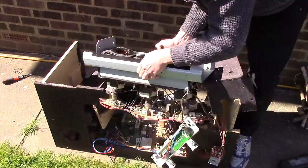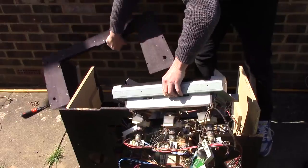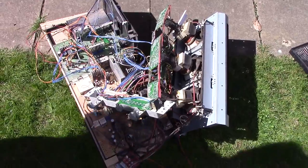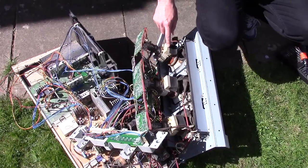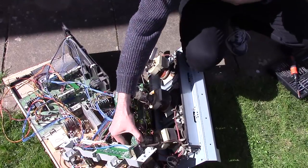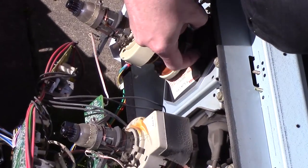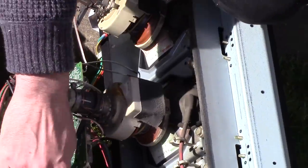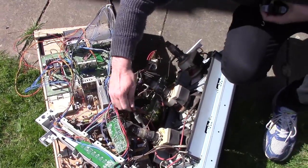Okay, recording. Short bars on the top. Okay, so we've got all the woodwork removed now and we're still theoretically electrically intact, but I'm going to pull the neck boards off this CRT unit and disconnect all the wires from here now, and these should actually just unplug in a fairly straightforward fashion to get us mostly free. These should unplug at this end normally. Get your finger under them. I can't get my finger under them, I'll do them at the other end on the flyback. Should also just unplug. There we go.